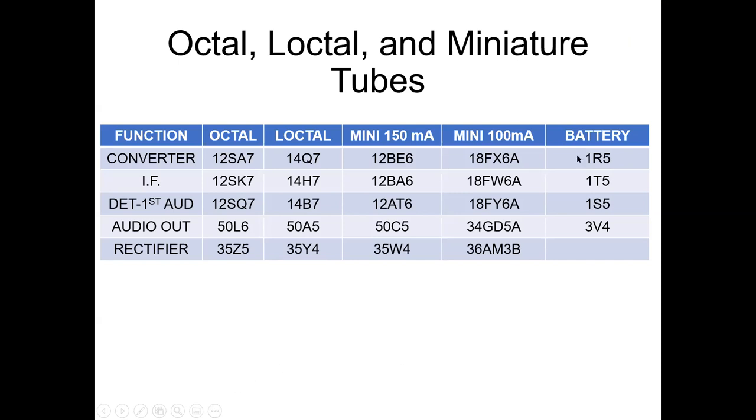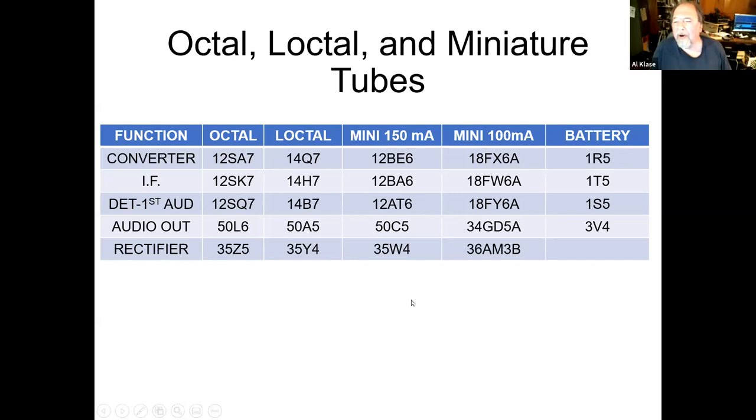And I just looked up the tubes, by the way, and you're absolutely right. That is the difference between them. So the AT6 has a little more gain, and there may be cases where you don't need the gain, and it'll just change the position of your volume control. I thought it was the other way around. I thought the 12AV6 had a little more gain. I don't know. I may be wrong. I know electrically the tube is identical, yeah. But I think the AV6 has a little more gain.